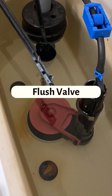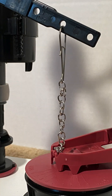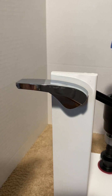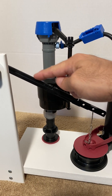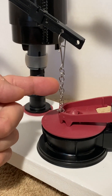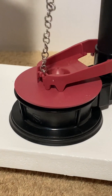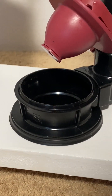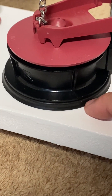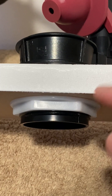How a toilet flush valve works — this will help troubleshoot problems. First, let's look at the parts of the flush valve. This is the entire flush valve. Here is the handle, attached to the lever, which is attached to the flapper by a chain between the lever and flapper. This is the flapper, and this is the flush valve seat. Here is the gasket that makes a watertight seal between the flush valve and the toilet tank, and the lock nut that secures the flush valve to the toilet tank.